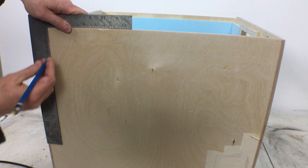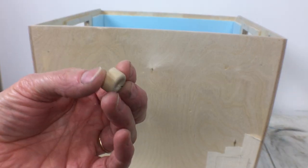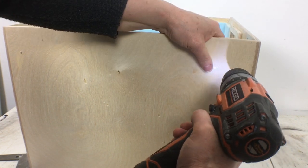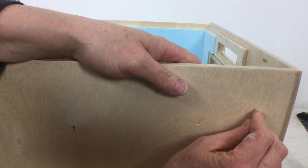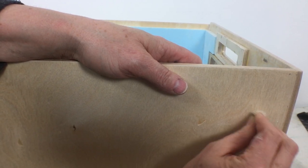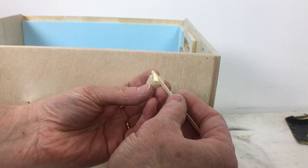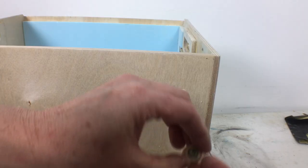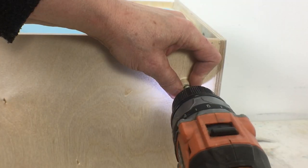Every kitchen needs a place to hang up a tea towel. But I don't want anything too big, so I made these little spacers that look like Cheerios. Those are going to hold the bungee cord away from the surface so I can tuck the towel in easily. Since I've already varnished the main box, I'm going to scuff up the wood a little bit so the glue grabs well. I only drilled a small pilot hole into the box, so I can use a regular screw to clamp the spacers down while the glue dries.